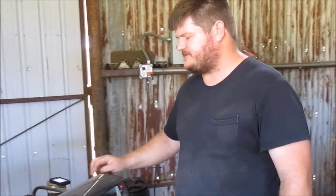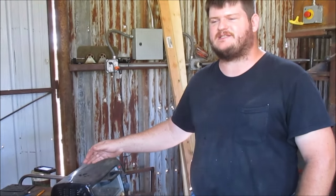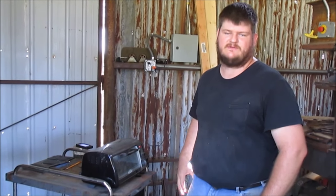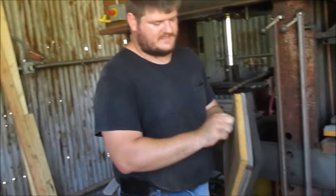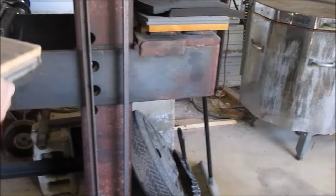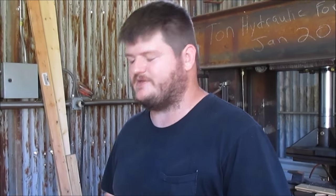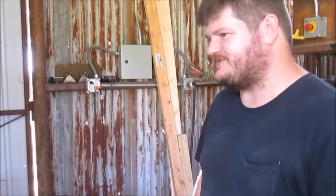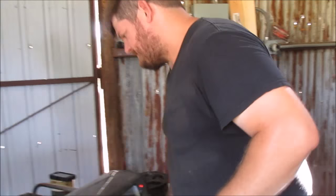The reason I want to replace my toaster oven is that if you have it set on, say, 300 degrees, one time that might be too cool, the next time it might be melting your Kydex — it is inconsistent. I've got a piece of thick MDF and some Kydex foam that I'm going to set on top, and I made sure I had enough clearance to slip that in pretty quick whenever the Kydex is up to temperature. We did not go from a cold toaster oven — we had already preheated it — and you can see how much the temperature is varying even though we haven't bumped the temperature setting. For what we're doing, the toaster oven is not appropriate; the size is good, it's just not consistent in holding temperature.